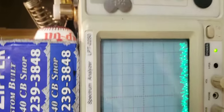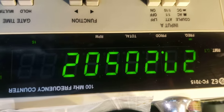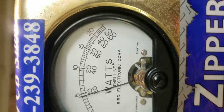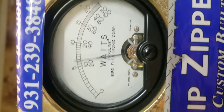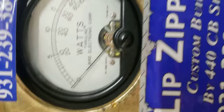Now we're going to go ahead and take a look at the power. We've got the 50-watt slug in as always. 13.8 volts - right here is our transmit frequency. Now let's check out the power output. So 50-watt slug, 13.8 volts. We're looking at RMS, also known as root mean square. Right at a 10-watt dead key. Right at 30 RMS.